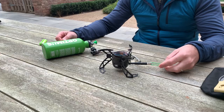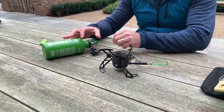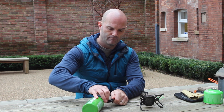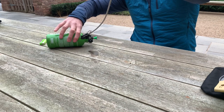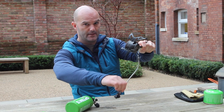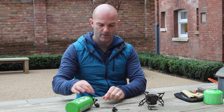Now I'm going to turn it off the wrong way and you'll see what happens. Instead of doing the bottle over and letting it drain, I'm going to just turn it off here at the control arm - turn that to off. It may squirt out fuel on here as well. Straight away we've got some fuel coming out of the valve. You can see the fuel coming out of the fuel pipe - not a huge amount, but fuel nonetheless. That is the difference between letting it dry out and burn through versus doing it the other way.